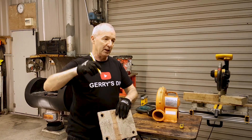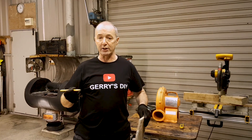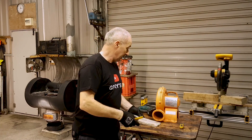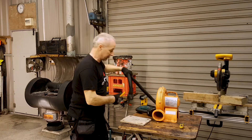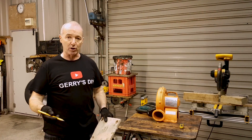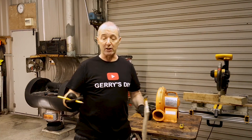The reason I want to do that is because as it's currently set up I need a four metre flue to generate enough suction to keep this going smokeless. If I generate the pressure to do the mixing with a fan, I don't need such a big flue - I might just need one high enough to get the fumes away. Anyway, for now I want to be able to attach a hose to this fan. The problem is if I try to put it there, nothing happens - I have to tape it up, which is what I did the other day. That was just a temporary setup. So to make it more permanent I'm just going to chop this. This is just a lump of something that was around.